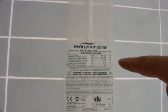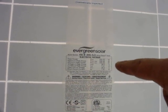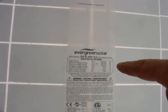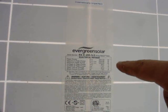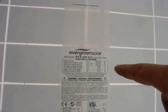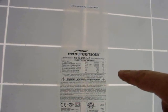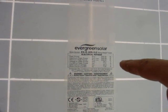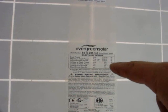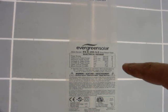Minimum peak power is 205 watts. Voltage at peak power is 28.5 volts — that's where the inverters start pulling power. Current at peak power is 7.21 amps, which is important because that tells you your wire size. On this system I decided to go with a little thicker wire than needed just to make sure the voltage travels well. Open circuit voltage is 35 volts — that's with the panel unhooked and you're just measuring across it. Short circuit current is 7.91 amps.